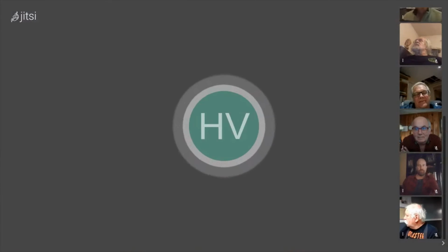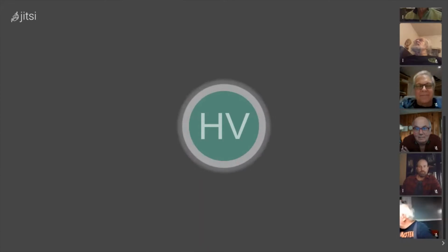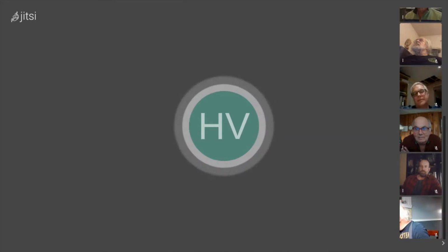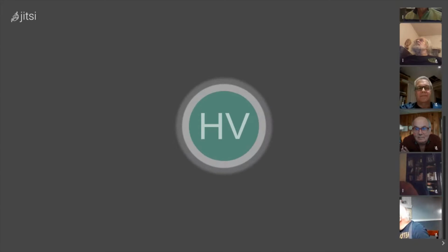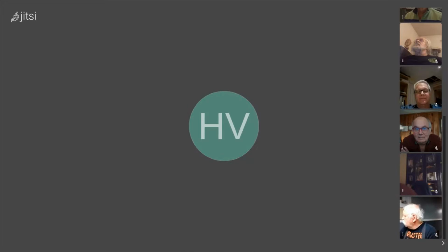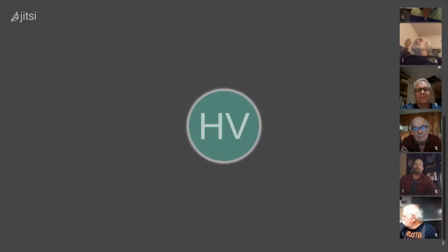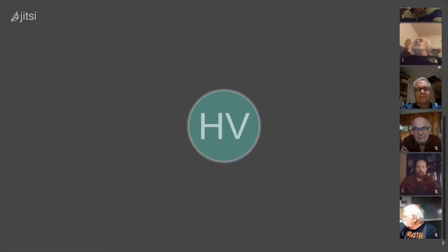Yeah, so I got my soldering station set up, and I started doing that 45-watt amplifier board with the surface mount soldering. So it worked. It actually is a lot easier than I thought it was. If you apply flux in the right way and you have a good soldering gun and get the right temperature, it's almost impossible not to get it. You just lob the solder on, drop the pieces on, you apply the soldering gun, just like putting a hairdryer to it, and it just melts and they align themselves perfectly.